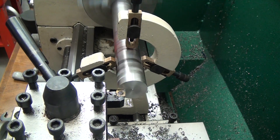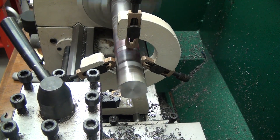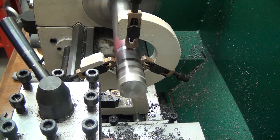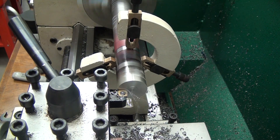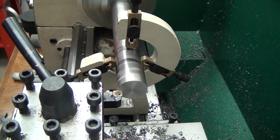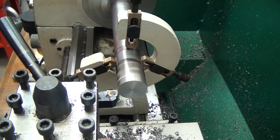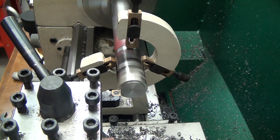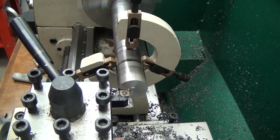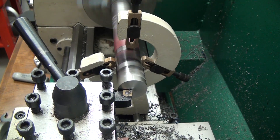Let's go ahead and make another cut — this is going to be a cleanup pass, and then I'm going to take a ten-thousandths followed by a twenty-thousandths pass. You'll notice this is quite a bit harder material — this is 4340 normalized and tempered — so there's a little bit of smoke coming off even at ten-thousandths. I could tell right away how much harder this was to cut than mild steel, but I also got quite a bit better finish. Here's the twenty-thousandths pass — a decent amount of smoke, and you're also going to notice the chips immediately start coming off straw and then go to purple and blue. These are hot — this is very hard material — but the cut looks great. The tool was doing its job, the steady rest was doing its job, no thanks to me.